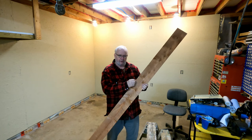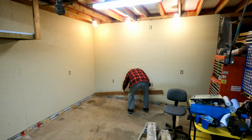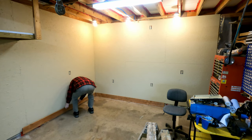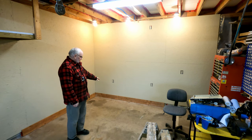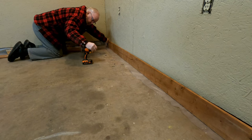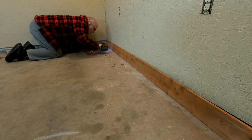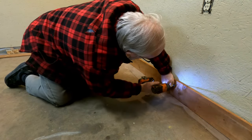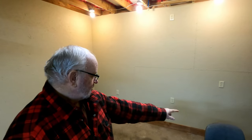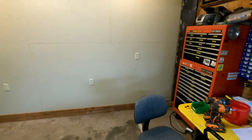This is just one by six fence board, so it's just barely three quarters of an inch thick. It's five and a half inches wide and we're going to lay that down here in the corners. I'm going to go around with the screw gun and make sure it's down good and tight to the floor, and we'll screw that in - just a couple of screws, one on top, one on bottom, where each stud is. I just finished getting all the baseboards in place and put the receptacle cover plates on - now I'd say we're done.